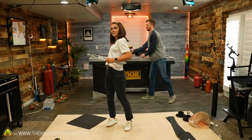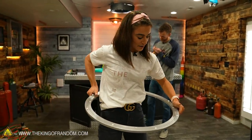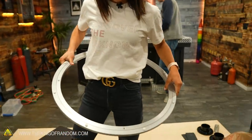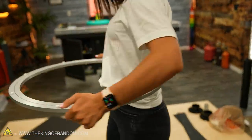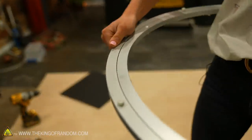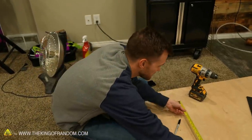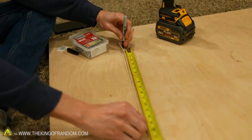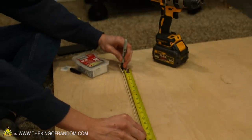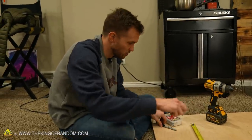We have a three-fourths inch piece of plywood, and this is what we're going to use to build our device. This is what you'd use on a Lazy Susan to make a larger-than-life Lazy Susan, but we're going to use it as a ball bearing system to get us spinning. The inner one isn't spinning — the outside one is. I am building a string compass to make our circles. We'll have a Sharpie and attach the string in the center to use as our pivot point to draw the circle.